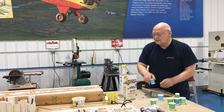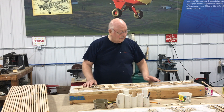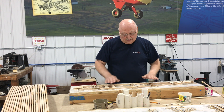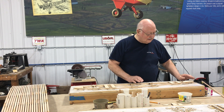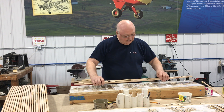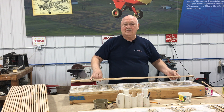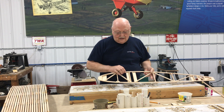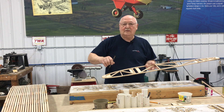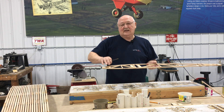When we're done with the mix, we take a paint brush and stir it. After this whole rib assembly is completed — it's down in the fixture and the epoxy is set, all the little gussets are in place and nailed down in the right spots — then we pry it up out of the fixture, throw the plastic away, and it goes to another table where they do the B-side. The main difference is we cover everything because there are trapped locations where you can't get epoxy in to weather seal it. So we cover everything with epoxy on the inside and then put the B-side on.